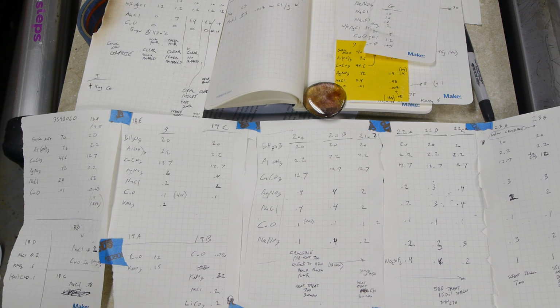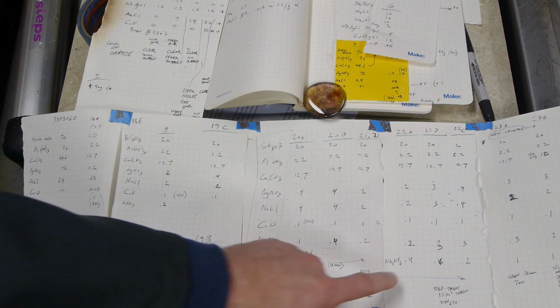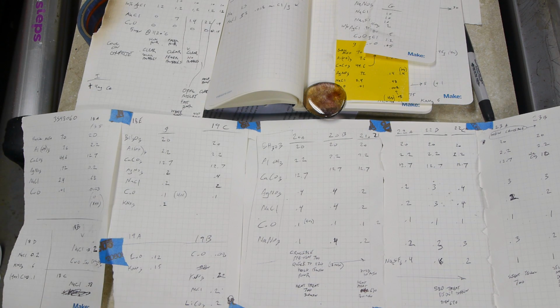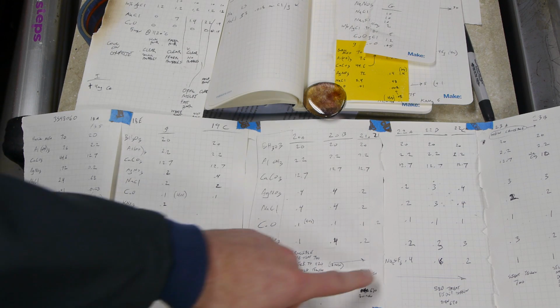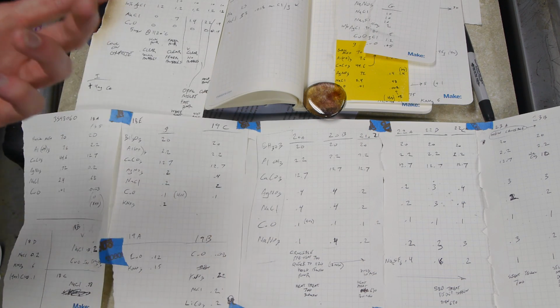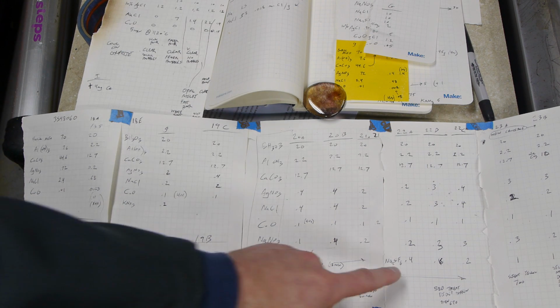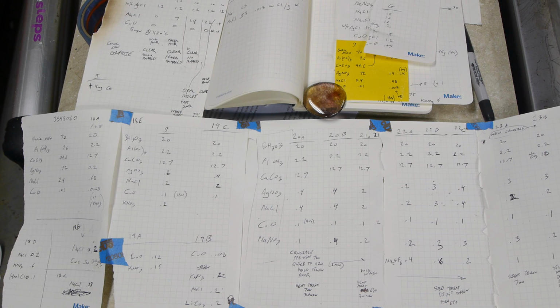So what we do is we heat treat the thing, and the silver chloride will want to aggregate into bigger chunks, and that way they can actually convert into metallic silver and give us this great photochromic property. So what we do is add some non-dissolvable stuff. These fluorides are apparently not dissolvable in the glass. They're still clear, but they're like little pellets sort of distributed throughout the glass, and they provide like a convenient source of condensing for these silver chloride atoms to start forming clumps. So if you're having problems getting the silver chloride to clump, you can add this and that will help out the process.